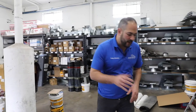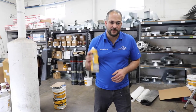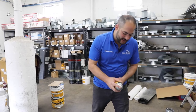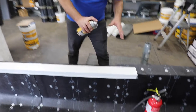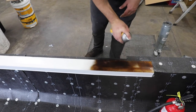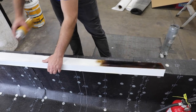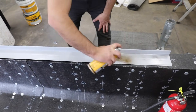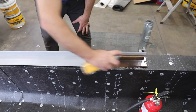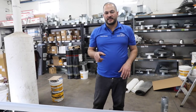Now that the vinegar is dry, we're ready to prime. We're going to be using any asphalt primer — this is a quick-dry method that's going to help adhesion tremendously. Make sure to prep the metal before priming. You want to get a good solid coat of primer on both sides — good, decent coverage. Make sure you get the backside done too, and I'm going to show you why shortly. Once this is all primed and dry, we're ready to install.